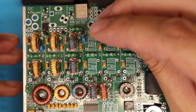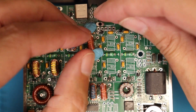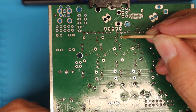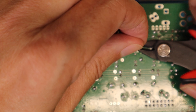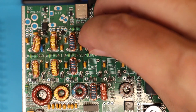The last thing to do is to solder your new inductor in place. With proper preparation, this will be a fairly simple task. I feed the wires into the appropriate holes in the board, then hold the toroid in place with a little blue tack. I flip the board over and give each wire a little tug to ensure they are tight. Then I add some flux — I like this paste flux in a tube applied with a toothpick. Don't be stingy with the flux; it really helps you get a good solder joint. Solder the leads, then clip them off with some flush cutters. Flip the board back over and remove the blue tack. There you go — one toroid installed.